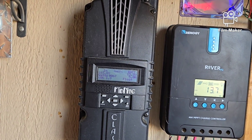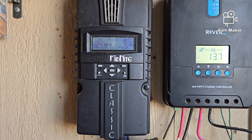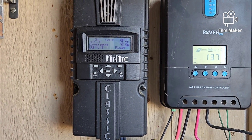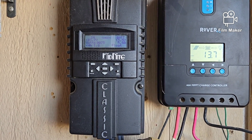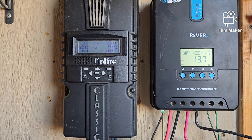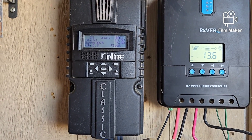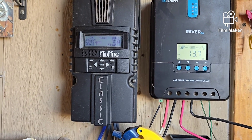You are saying you have 24-volt panels. I need to know what the VOC is on the back of those panels — the voltage open circuit — because that makes a difference. On a 24-volt panel you could have a VOC as high as 46 volts depending on the panel itself. That VOC will determine what you're going to do.